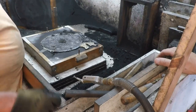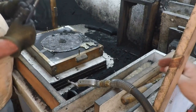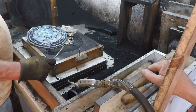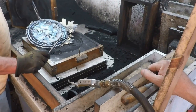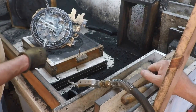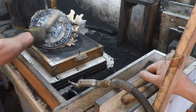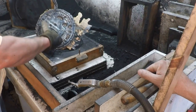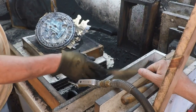I've got to be careful though. Some pliers would probably be helpful. This is what a horrible casting looks like when all your metal runs out the sides of the flasks. All these huge divots — it's deformed. I've never seen one look like that. The letters did come out, I mean they're there, but they're not really. Of course, this is completely unacceptable.